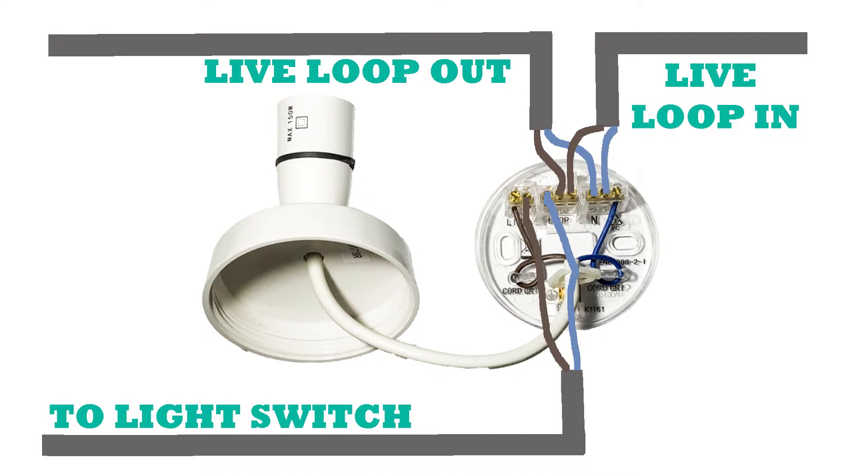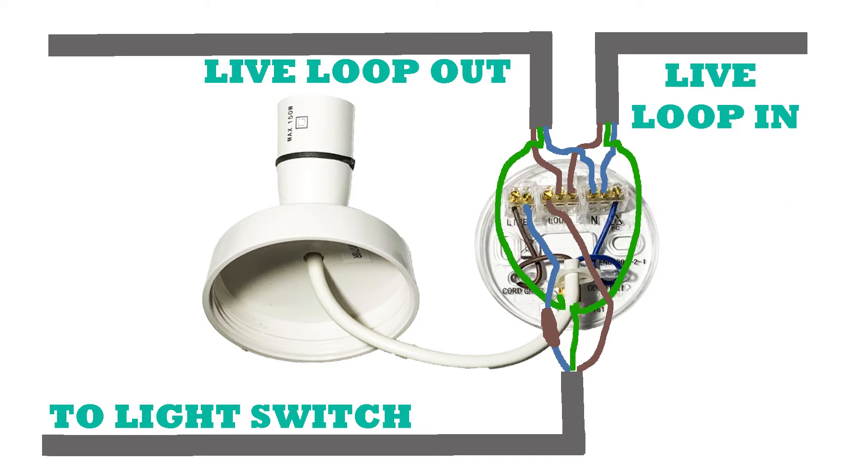So as you can see, a switch is inserted between the live and loop terminals, which gets between the live feed in and the lamp itself. Of course, being a switch wire, if you're using brown and blue twin-and-earth, you need a little bit of brown tape or sleeving to note that that is actually a live wire and not a neutral. And adding the earth back in, that's what a finished ceiling rose should look like. Obviously the wires don't come in from the side — they'll come through the hole in the middle of the ceiling rose — but for clarity we've just shown side entry on our diagram so it's easier to see what's happening.